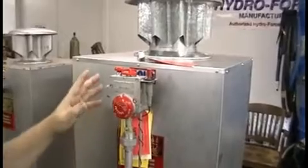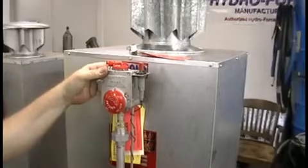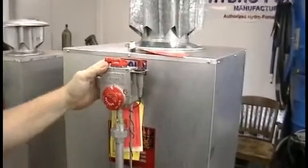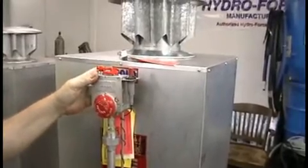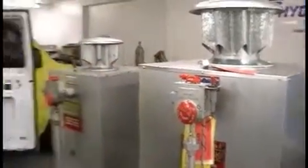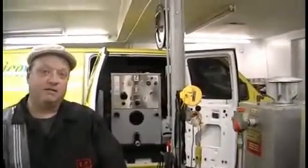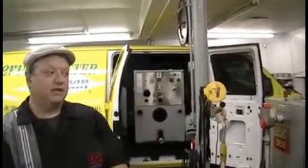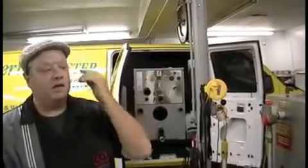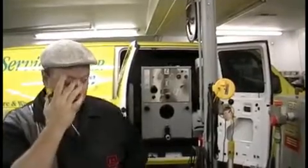Another thing about this heater, under extreme conditions, commercial or doing tile floor, it only burns 0.9 of 1 gallon of gas per hour, which is amazingly efficient. Residential, it probably burns about a half gallon an hour of propane, maintaining high temperature too. And the reason it does that is that when you release the trigger more often, it shuts the flame off, and that's why it'll save more fuel.